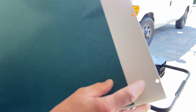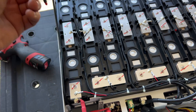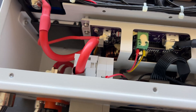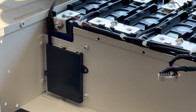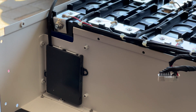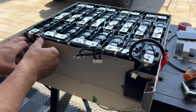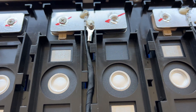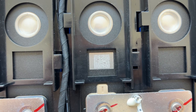On the top cover we have insulating material to protect cells from touching the metal. There's something that looks like a temperature sensor going into a small enclosure, but I didn't see that enclosure connected to the BMS. So I disassembled it to see what's inside. The device is not connected to the BMS and has no wires — just one temperature sensor. I checked with engineers from StackRack and this is actually a fire arrestor. On the right side of the battery case there's another fire arrestor and a pre-charge resistor. Interestingly, all the bus bars are welded to the cells and additionally have screws for extra protection. The cells can't be individually removed because they're welded, but there are QR codes on each cell just in case.